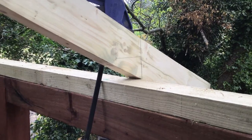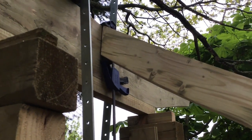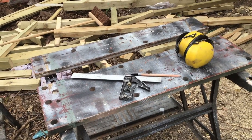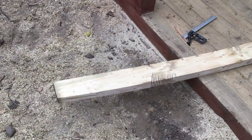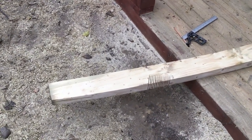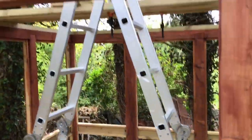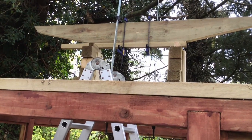I put it into place to get the correct dimensions. As you can see I've already cut that — I just marked it out and cut the angle so it'll just slide down. I used a square, a rule square and a pencil — nothing more complicated. I've used the circular saw to slot down the lines and I'll just knock those out. I can't use a router, so I'll use a chisel to level the base out, smooth it up and slot it into place against the ridge, then cut and file if it needs adjusting.